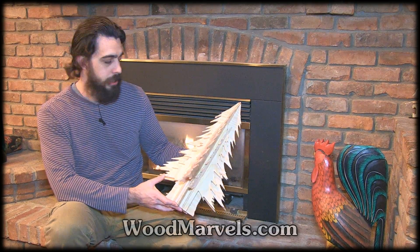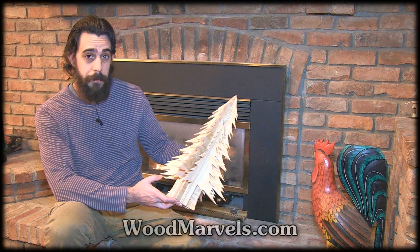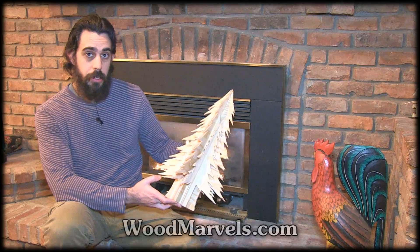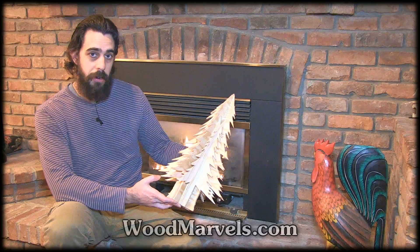All you need is four sheets, 500 by 400mm, using 6mm thick material, a 1/8th standard double flute bit, and I used a ShopBot desktop to cut this one.